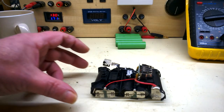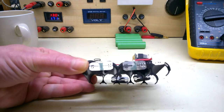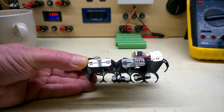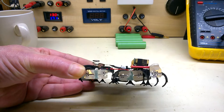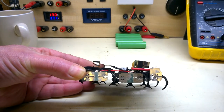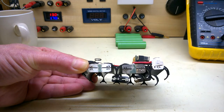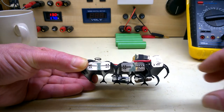These original strips are 8 thou thick, or 0.2 millimeters. I possibly could weld them, but I don't know what material they are — I don't know if they're nickel-plated copper or ordinary nickel strip. I'm not going to break out the welder to do these, I'm going to solder them.